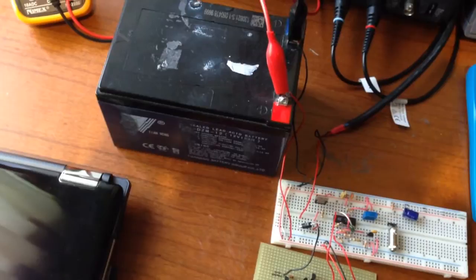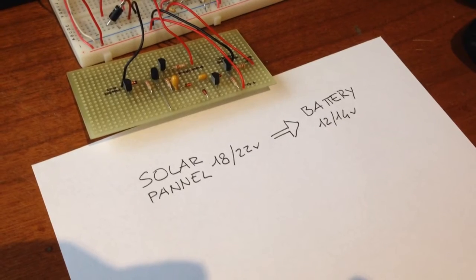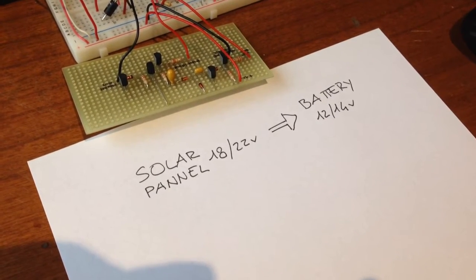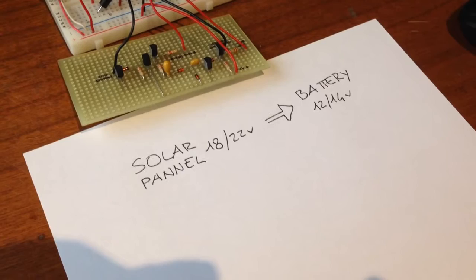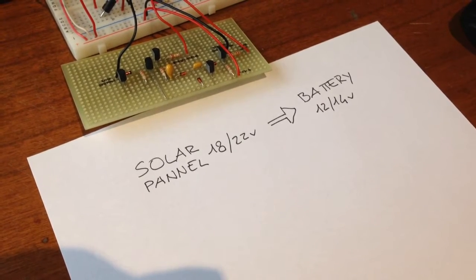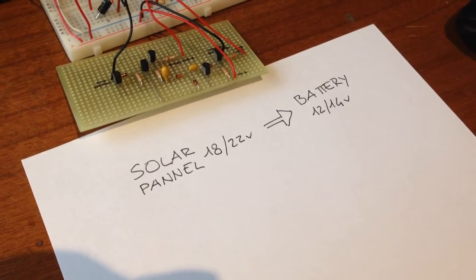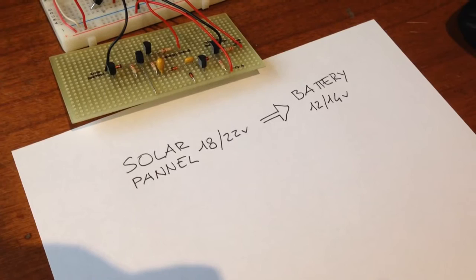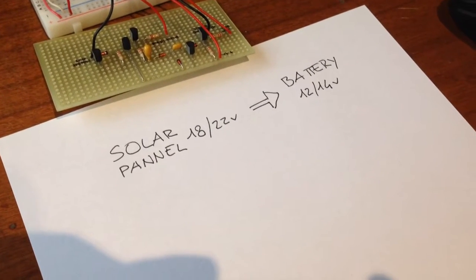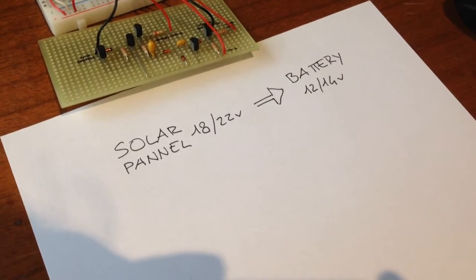I've been working on this project since pretty much last summer, and here's my rather small 12-volt battery. So what is a solar charge controller and why would you want one? Well, can't we just connect the solar panel directly to the battery? We could and it would certainly work, but it has some downsides. By connecting the solar panel directly to the battery we risk overcharging it, because the solar panel open-circuit voltage is somewhere between 18 and 22 volts depending on lighting conditions.